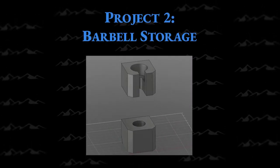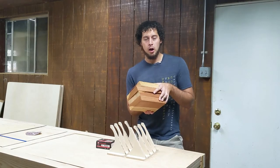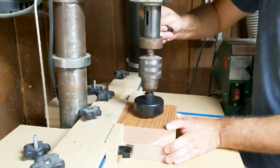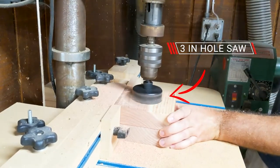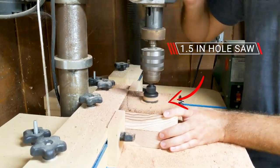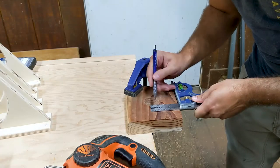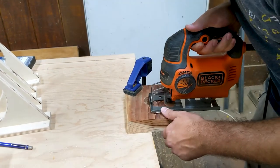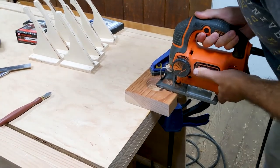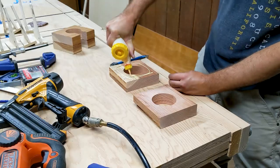The next project I have going on is to make a holder or a little bracket for my barbell using these four pieces of off-cut redwood — they're two by sixes. I can make a three inch circular hole right here and my barbell can fit into that. The next piece under it, I'm going to glue two together. That piece will have a one and a half inch hole so that the bar of the barbell can fit through that one. Then I'll use my jigsaw and cut two channels so I can take it in and out. The bottom two pieces are going to be on the floor with a hole in it for the barbell to fit in.